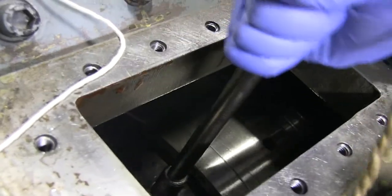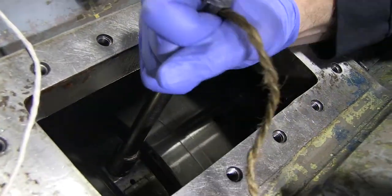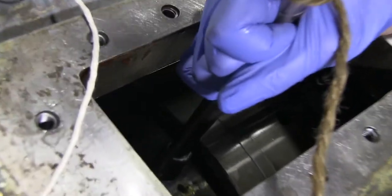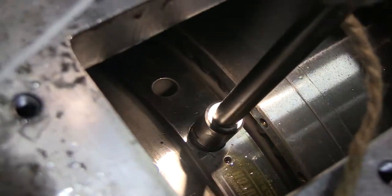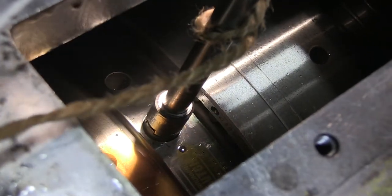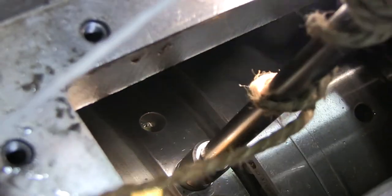We're turning it counterclockwise, and again this is where that lanyard is going to get wrapped around the top of your tool. As you get closer, there's an oil port and oil will start coming out of that port - that's a good indication that your clutch is in fact engaging as it presses that oil out. Also, the tool will now lock in place because when the clutch is anywhere between engaged and disengaged, that tool is going to lock in place. There's no way to get it out until you get it either fully engaged or fully disengaged - that's to prevent damage to the clutch.